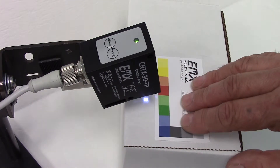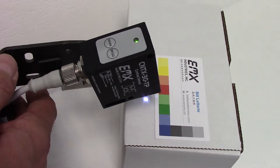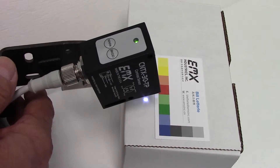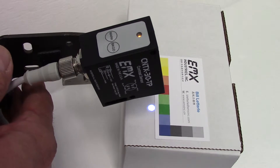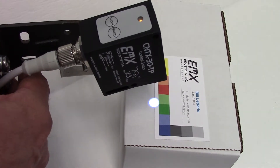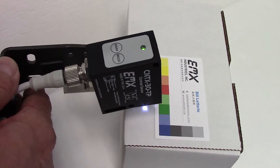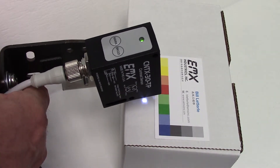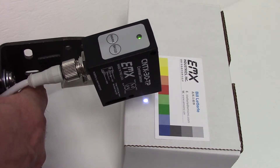The light spot is approximately three millimeters in diameter and when we set the sensor up it is focused at approximately 28 millimeters from the target surface. Moving it up and down, we can see that the spot gets larger as we move further away and smaller and more blurred as we move closer. We are going to visually set this up for the best focus, which is going to be at about 28 millimeters.